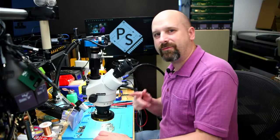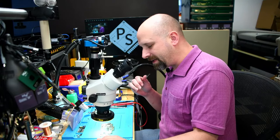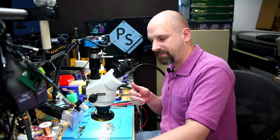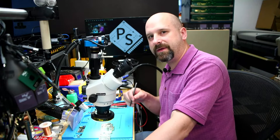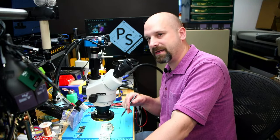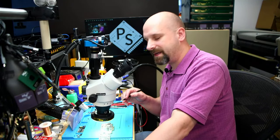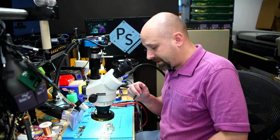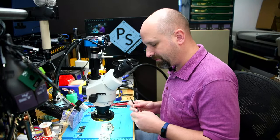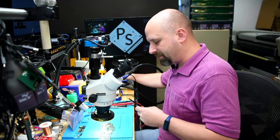There's one power rail chip that has been on Apple boards for many, many, many years. And I find it on other boards. I've changed it on other laptops, Lenovos, and stuff like that. It is one of the sturdiest, most long-lived buck regulator chips I've ever seen, the TPS51980. That thing, for 3.3 volts and 5 volts, is on a plethora of different boards. And it has been a workhorse for designers to use in all kinds of boards. Unfortunately, it's gone now. I'm sad to see it go, because that was just a really sturdy chip. It took a lot of abuse on the old MacBook Air boards. It always got liquid damaged, and nothing ever happened to it.